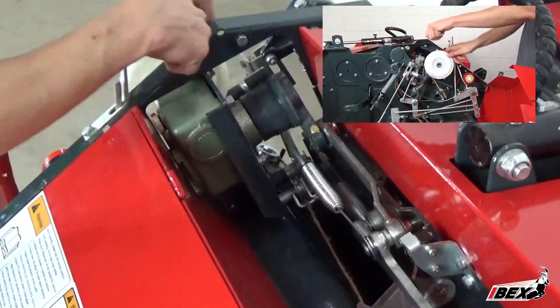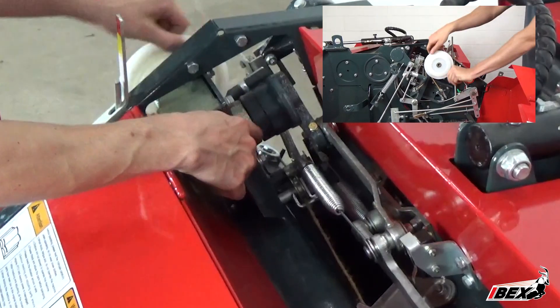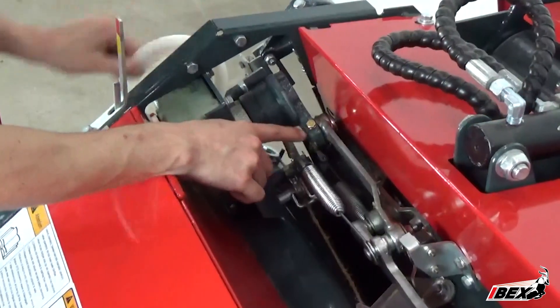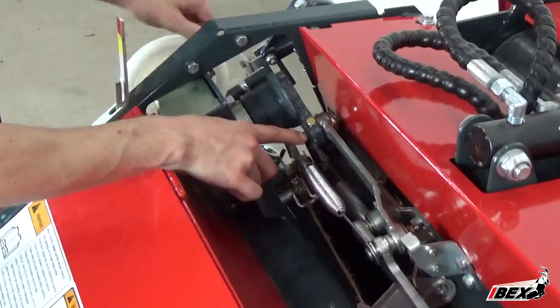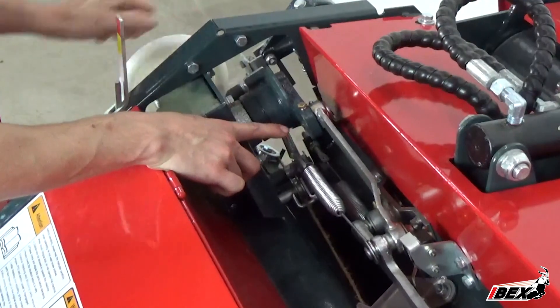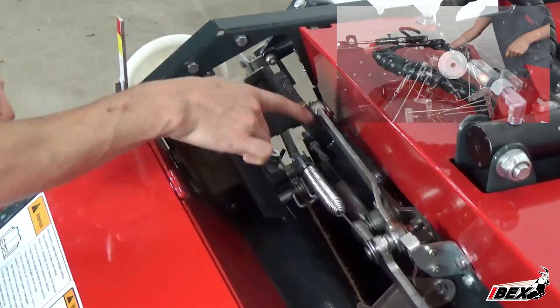To adjust this, spin the white twine pulley clockwise a few revolutions until the cam arm overcomes the parallel resistance along with the linkage arm. You will then see the cam arm linkage pop upwards when they are in sync and ready to be set. Once this happens, you can then lift your twine arm with very little resistance.